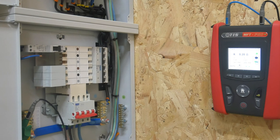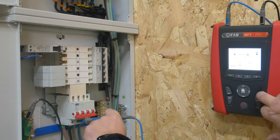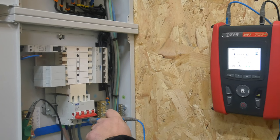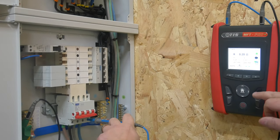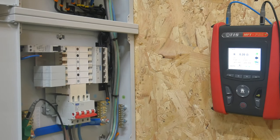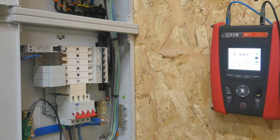I'll go and swing that linking wire over now and then we'll repeat that process through these three. You've seen me run through that process now and we've got roughly 0.20, 0.21 — I think one of the phases popped up, I think it was the L2. But roughly speaking we're about the same, which is a good sign because that means our cable is generally intact.